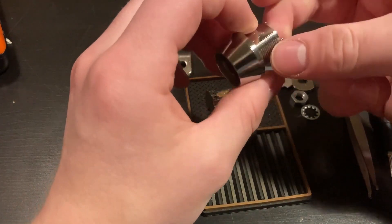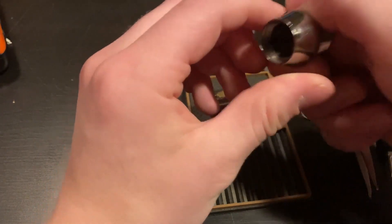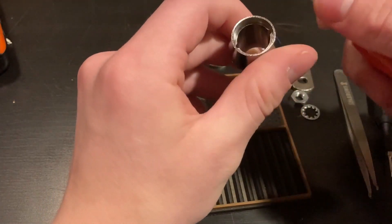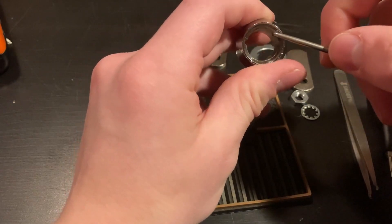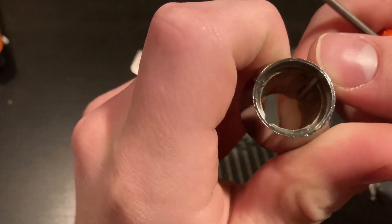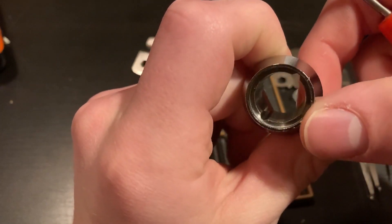Let's start on the body itself. It is threaded because you screw it in like a cam lock. Inside, there are two sidebar slots located 180 degrees from each other. They are fairly rounded, not the sharp angular ones like ASSA does.